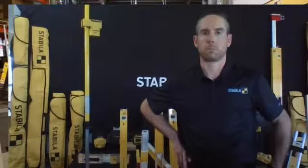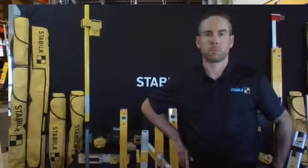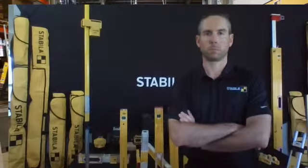What I do now is we're going to change those top corners. I'm sure I can finish that right top corner. This is where it gets good. So I take my 78-inch level, and we go down the inside of one side of the door, and I'm going to make sure that this is perfectly plumb, and it's going to go to the frame. And now as I slide in my shims right above those hinges, I'm going to go ahead and shoot my finish nails right in there, all the way down the bottom. Now that side is stitched up.